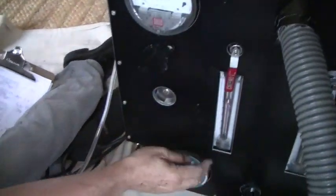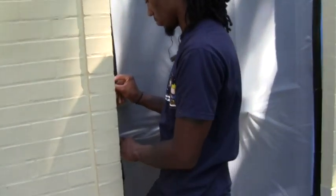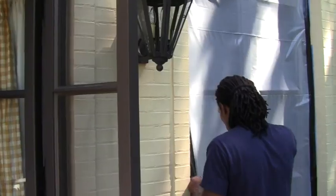Since we're pulling air through the chamber right now, these flow meters are going up. We've taken our reading with the tear sheet in place, and you can see that it is connecting up because this tear sheet is being pulled in. And so now to get the differential reading, we're gonna have Chris pull off that tear sheet right now. And as soon as he does that, we're gonna see a reading difference here.